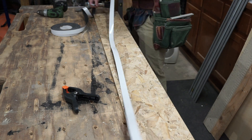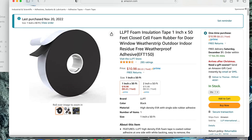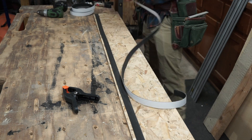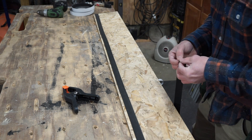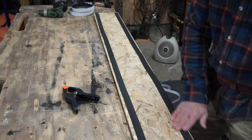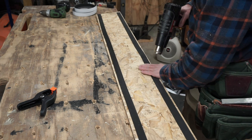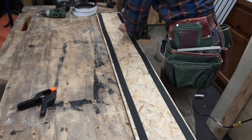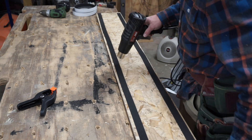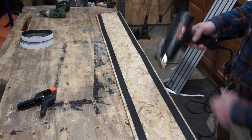Time for the secret sauce. This is just a weather stripping that I found on Amazon — it was inexpensive and appears to be fairly durable. I'll show a picture of it and I also have a link in the description if you want to buy it. It adhered to the back of the DIY track saw fairly well. My shop is cold — I'm doing this in December in Michigan — so I hit it with a heat gun, which seemed to activate the adhesive. After the heat gun, it stuck on and didn't want to come off. If you don't have a heat gun, a hair dryer would probably work just as well — actually probably better, since the heat gun can melt things if you get carried away.